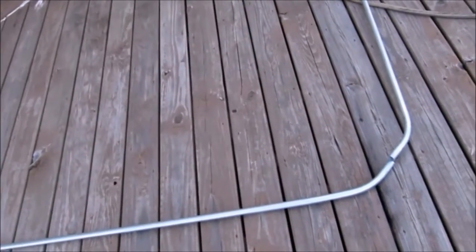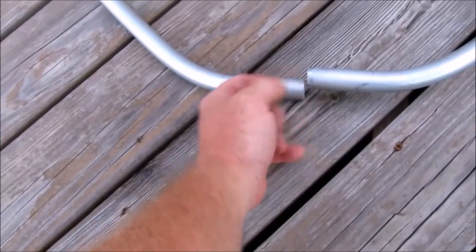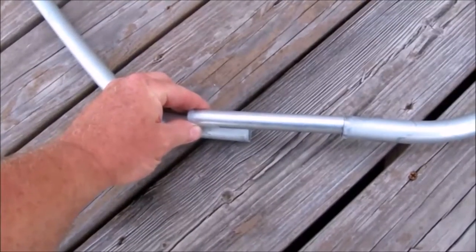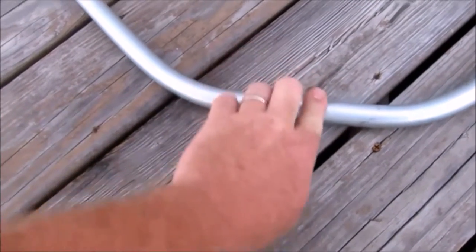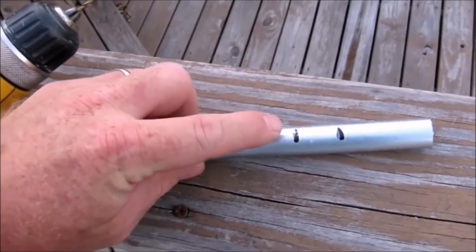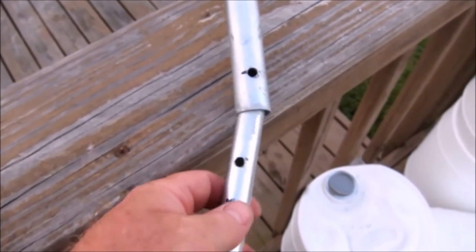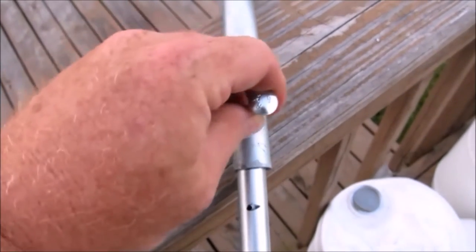To complete this rib I have to fit these two pieces together. I'm going on the inside with half-inch EMT - that way all I've got is this one joint that could potentially grab. There's the piece - six inches - I'll go in some here, then one-handed for the camera I'll go in here. We need to fix those two pieces together so it's not loose. On this half-inch connector I measured to the center and measured an inch away on both sides, drilled a hole here and here, and now I'm going to put a carriage bolt through it.